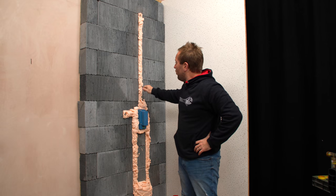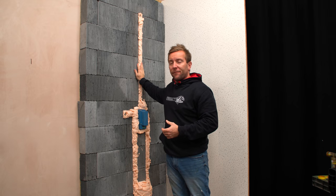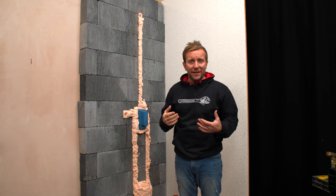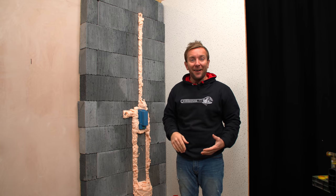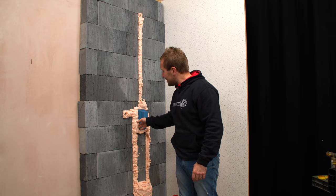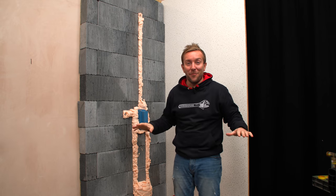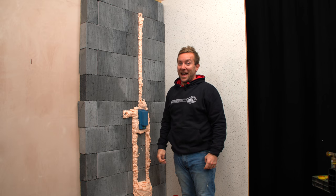It's the next day. All of this is rock hard now. Hopefully you can get an understanding as to why I prefer to use expanding foam. The main reason is that it goes all the way around the joints, right at the back. The old school way of doing this would be to actually cement over the copper pipes and protect those copper pipes with newspaper or the old type hemp insulation. You don't need to do that with this — this stuff does not attack anything on the copper or the brass. And now, this is probably the most satisfying part of the whole job — cutting away all of this.